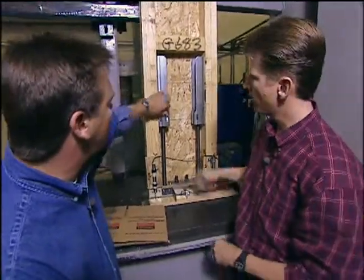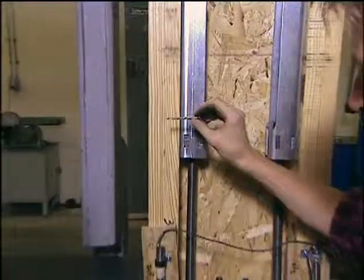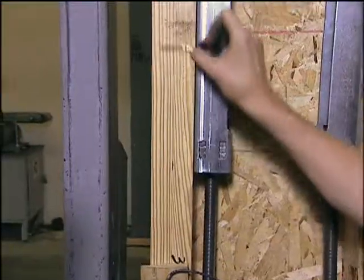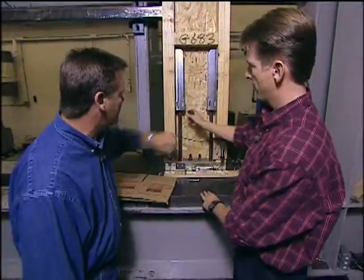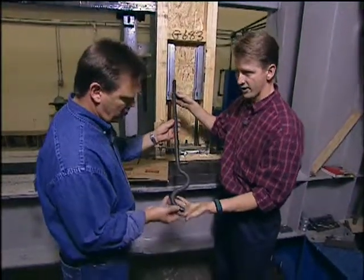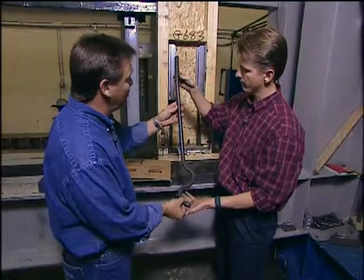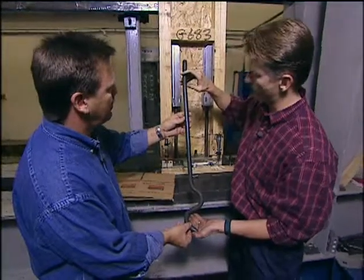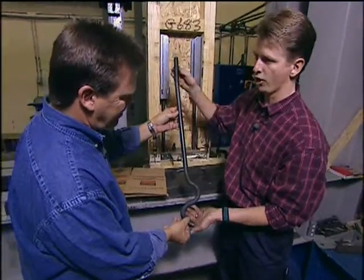How are they attached? The hold-downs are attached to the structural wood member with our strong drive screws. We've got 20 of these screws holding the back plane of the hold-down to each post. What are these rods doing? Where do they go? This is a hold-down anchor bolt. This goes down to the foundation and will connect with a coupler to this SSTB 28, which is cast in place in the concrete. This is the embedment line of the product, so everything below this line is below grade in the concrete.